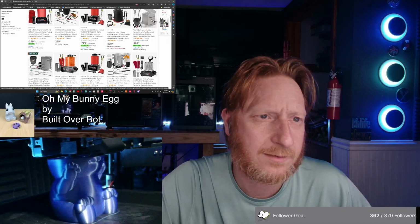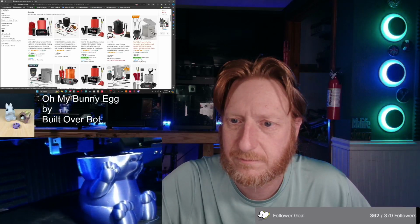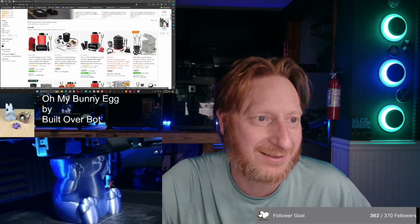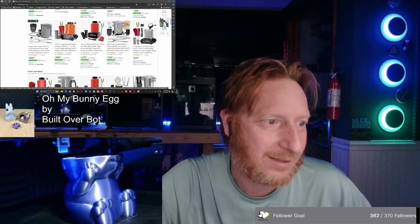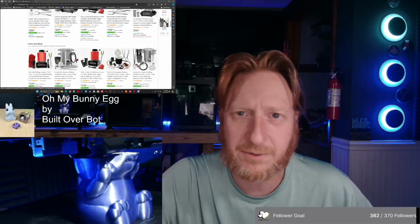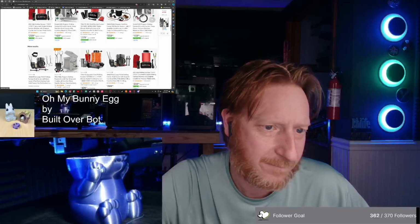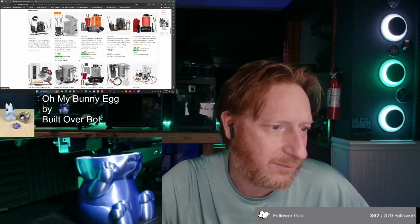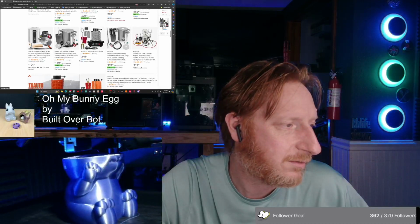Here's a 15-pound, one of these real big ones. I don't know what we're gonna cast. I don't think steel. We're not gonna be able to do steel with these. They claimed they were able to do steel, but no. Steel is like 25 to 2800 Fahrenheit. These things don't go up that high. I think the biggest one that we found so far was like 22.